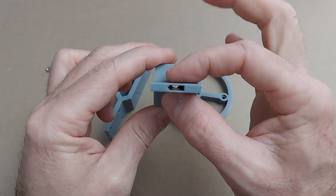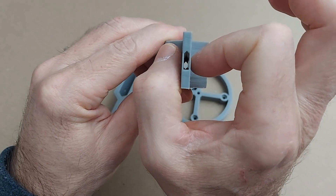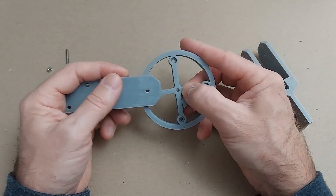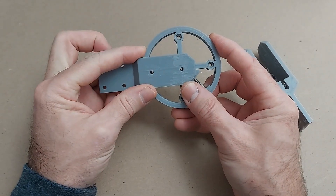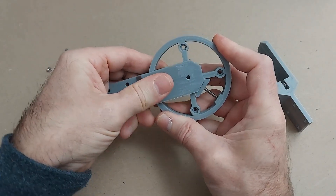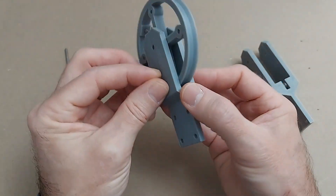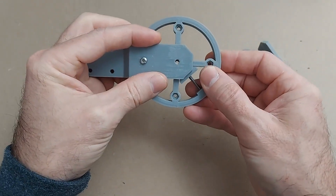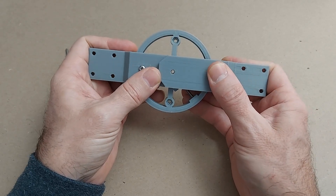This arm has a hollow channel, so you print it upright and the top is peaked intentionally so it doesn't require any supports — it's nice and clean and ready for your cables. The pulley goes into the smaller of the two forks and the trolley kicks off at about a 45-degree angle facing out. Line that up and put a bolt in that first hole — that locks it in. On the back it'll still move, so make sure it stays lined up.